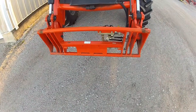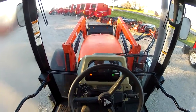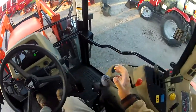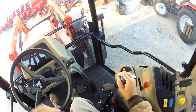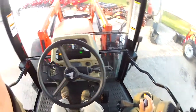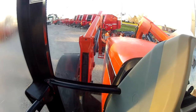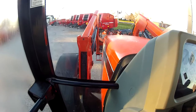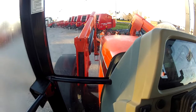The first thing you need to do is get the tractor and loader lined up. Take your joystick and turn the tool carrier all the way down — you'll see it coming down. You want to rotate it all the way under, and if you look, you can see down through the bottom of that tool carrier.